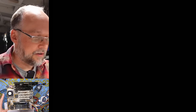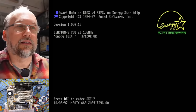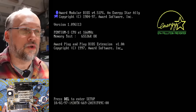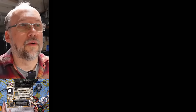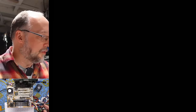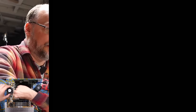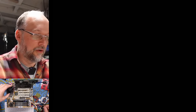I think we're ready for testing. Let's power this on. The fan is running. The system is posting — it thinks it's a 166. Maybe there's a jumper to configure for Pentium overdrive. I seem to be having some trouble booting. I don't think it's related to the CPU — I think this has to do with my compact flash card. I've tried a few different things in the BIOS like large and LBA mode and none of those seem to work. I guess we need to go back to the original CPU just to see if this is a problem with the overdrive somehow. I'm just going to place the cooler on there on top of the chip with enough heat sink compound just for booting a little bit.